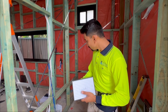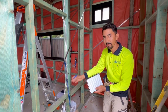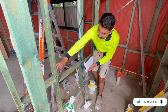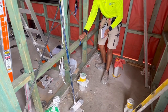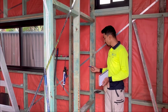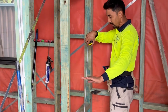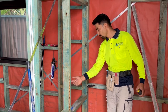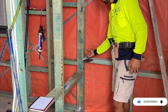Now I'm in the bathroom. All my plumbing work will be done inside this wall. I've got the vanity here — I'll be doing two connections for hot and cold water. I've got my toilet here and need to run a pipe for it. The shower head will be here and I need my mixer installed about one meter from the ground. I need to cut a timber and install it here to support the mixer, and cut a hole through this section to access the external pipes.